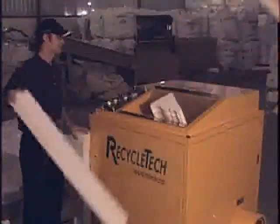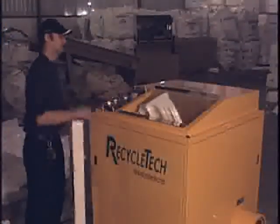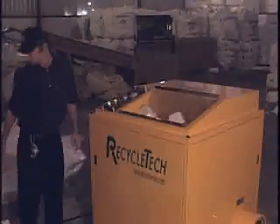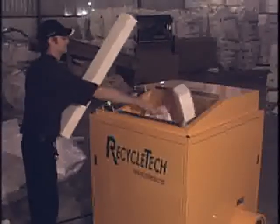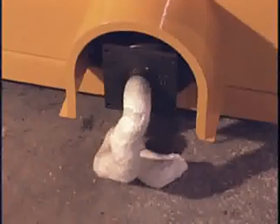The unit can even be mounted on a truck for a mobile recycling station. In either situation, when installing, place the unit on a stable, level surface making sure to leave at least two feet of space between the wall and the back of the unit. Also allow for adequate working space at the front and right side to feed the material and for the output of the compressed material.